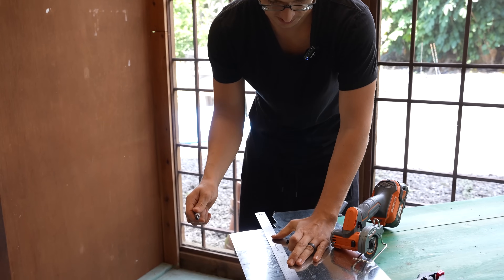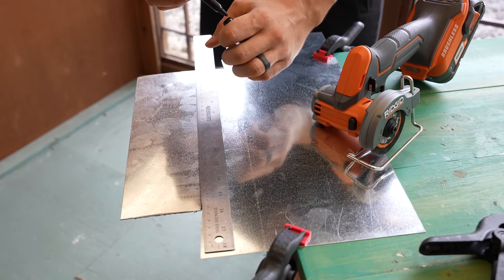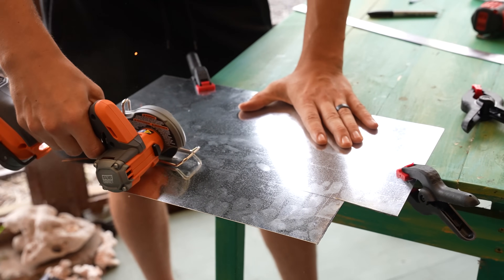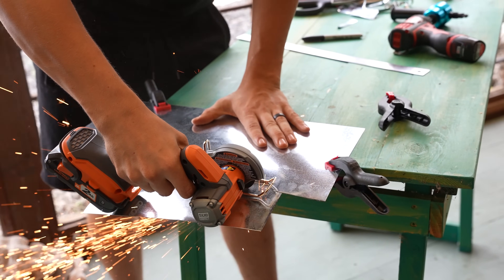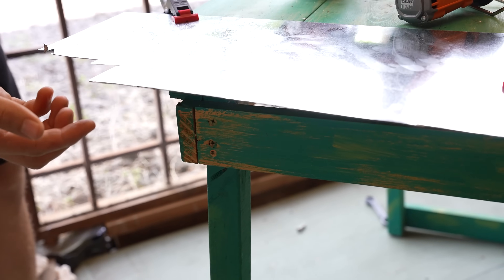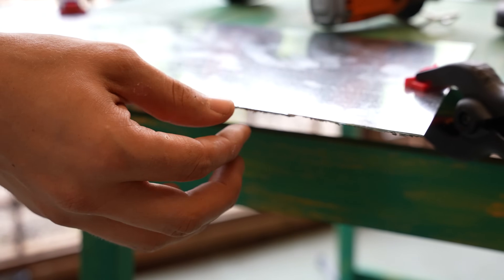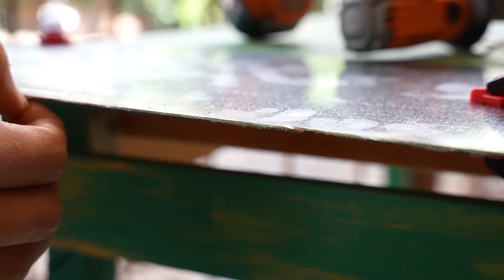I love using the grinder. Let's go ahead and cut off another piece — let's make it a little bigger this time. Grinders are just awesome to use; I think it's so much easier than using a pair of snips. And of course it's a nice, really clean cut, although it does have some jagged ends towards the inside. So do keep that in mind when using a grinder. Depending on what you're using the hole for, you might need it really clean — in that case you might be better off using a pair of snips.